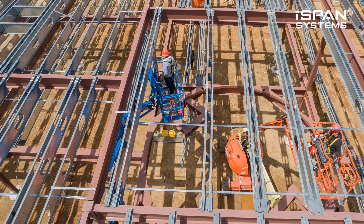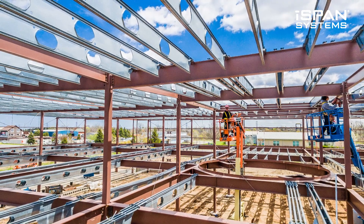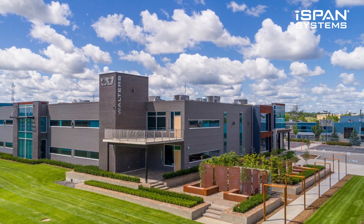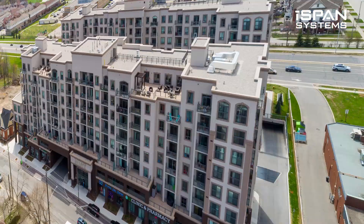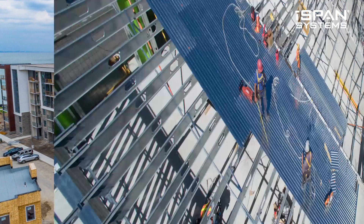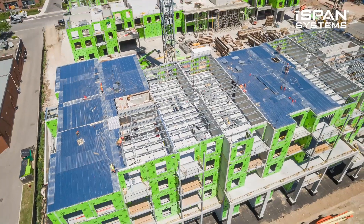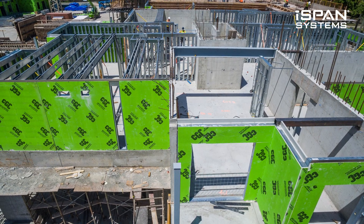Combining that deck with a joist makes it a very economical and efficient system. There isn't much out there right now that would compete with this product. It's been an amazing trip. Always anxious to see — are we getting that load? Yes, we got that load. We can calculate this load. And it was truly amazing to witness all of that. When you look at the flange, it has two thicknesses, and given the right spacing of those rivets — and now the clinches that are being used — we can develop that full compression flange capacity. A very, very efficient product. Really enjoyed working on this, and much success to the company.